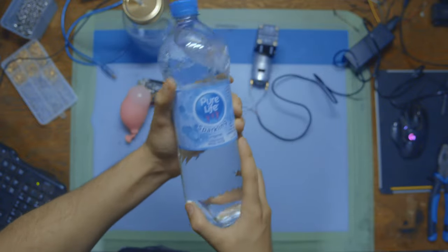Let's get those marshmallows in there. Just going to stuff as many as I can in, put the lid back on, and plug that into our vacuum pump one more time. The slow-mo cam is on. Look what's happening to those marshmallows every time I plug the pump in and out — every time I put that pump in there, the marshmallows expand for the same reason the balloon expanded. The air in the vacuum chamber is being sucked out, so everything inside is trying to leave the chamber, and the difference between atmospheric pressure and the pressure inside the container is changing drastically.